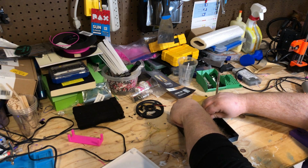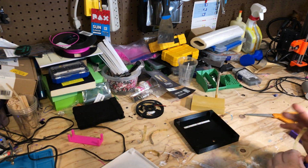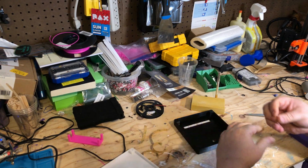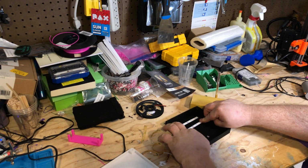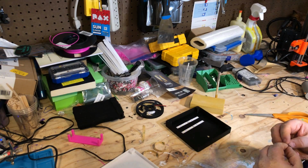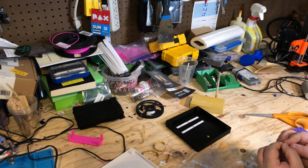It doesn't have to be particularly accurate or straight, because there's enough diffusion in here. You should not be able to see the individual LEDs anyway. On the shell I use a 2mm thick shell, which seems to diffuse most of the lighting pretty well, to where even if your LEDs are not completely aligned properly, they get hidden pretty well. So it's a pretty good little setup.